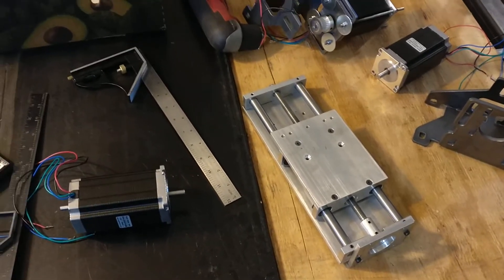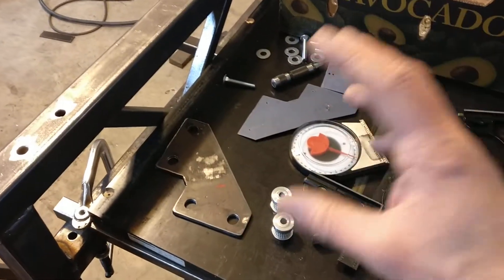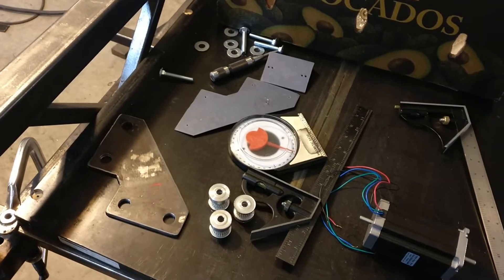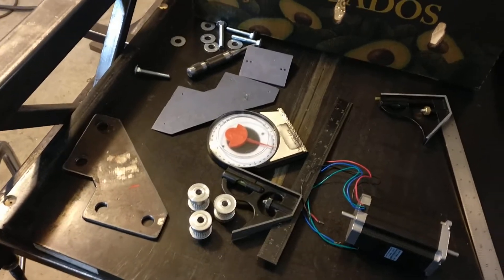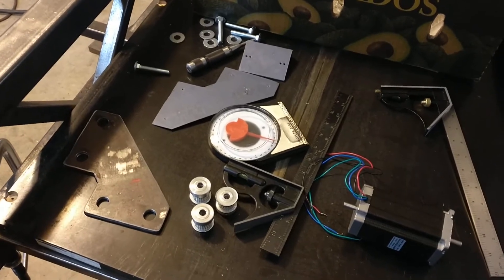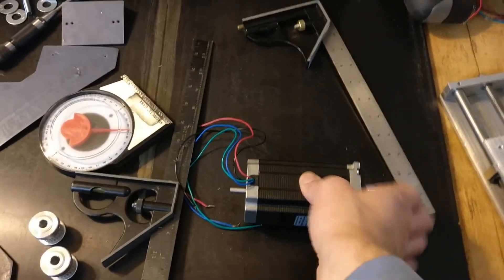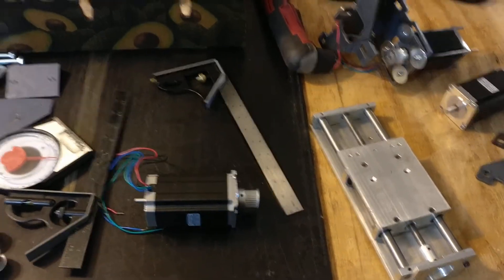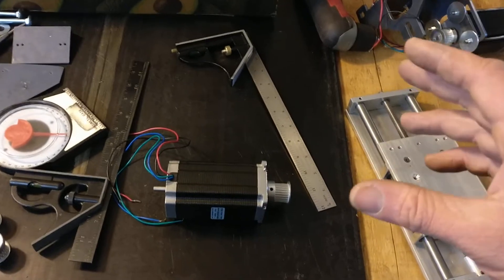If I had a functioning lathe — because those videos are for another time — this problem would be easy to solve. I would just bore the pulleys out on the lathe from quarter inch to eight millimeters. What I ended up doing instead was drilling them out very carefully to just below eight millimeters with my American-sized bits, and then reaming them open with sandpaper. It was a mess and a pain in the ass, and it gave me some very tapered and conical holes, but it seems like it will work. The fit is not the best, but at least it is tight on the ends where it does matter. So it'll probably do at least until I get the rack and pinion for an upgrade. And if it doesn't work, I can just order the right pulleys online — but the fact of the matter is, it was a pain and it was my fault.